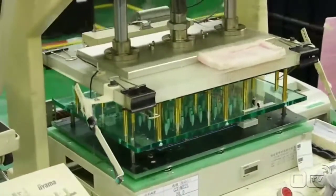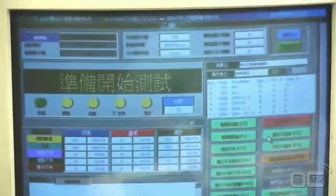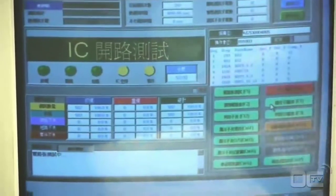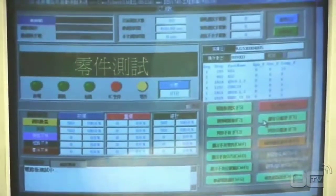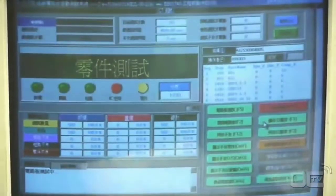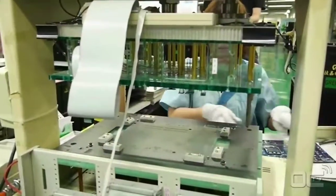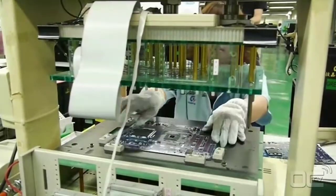The ICT tests if the chip is well soldered electrically to the board, but does not test if the chipset itself is working. This factory floor is dedicated to additional verification, specially for server components. Some boards are tested by X-ray to verify the quality of soldering — a high-quality service that allows very high-end and server motherboards to be checked in more depth.